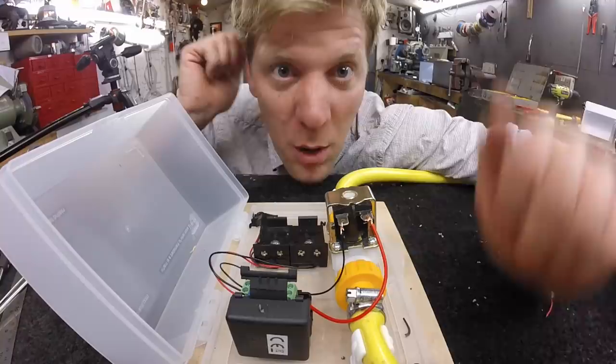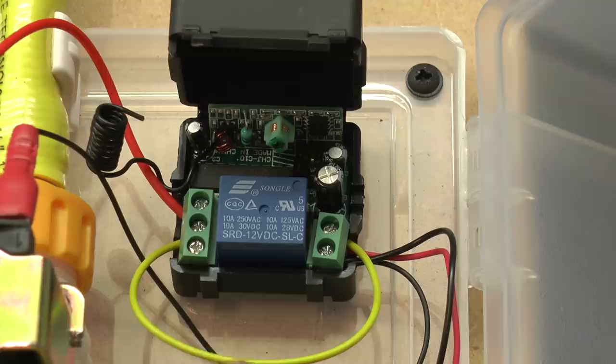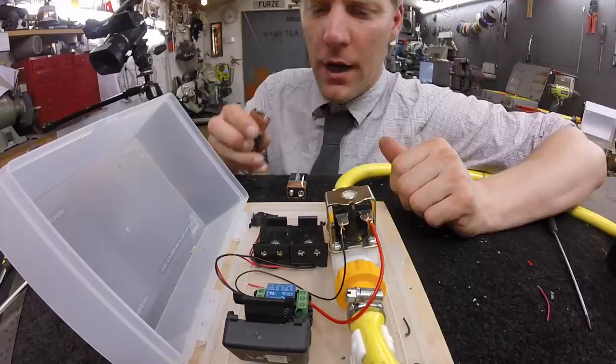After I finished the video I had to make another one for the book and found that the circuit board I used here is a little strange, because nearly every other circuit board needed an extra wire. There'll be a wiring diagram on screen — basically you need to take a second wire from where the positive goes into the plus side of the circuit board, around and into the common port. Why this one works without it I don't know, but that's cheap circuit boards for you.